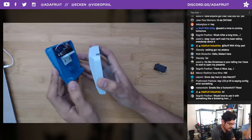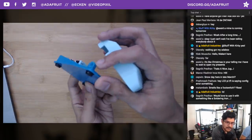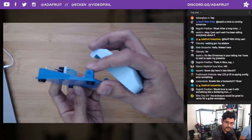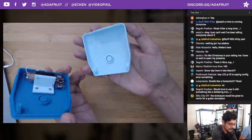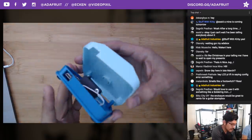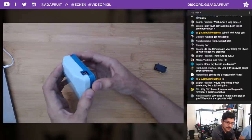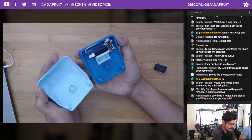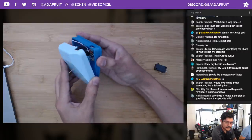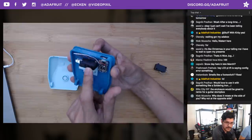So what's cool about the 3D printed hinge is that, again, it doesn't require any hardware, and it's got this dimple feature, right, that's nicely at a 45 degree angle, which most 3D printers can totally resolve. And then on this side, you have this same feature, but it's protruded. So when you mate them together, they create this pivot point, and they make this satisfying click sound, like that. So there's no spring in there, but you could add a spring if you want. I added these little spring holders that would hold a spring and keep them far apart from each other.